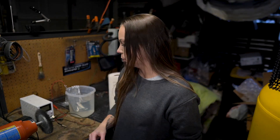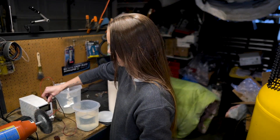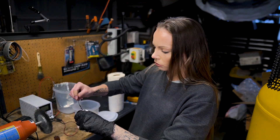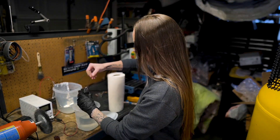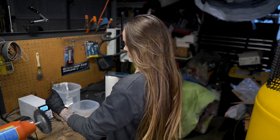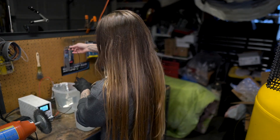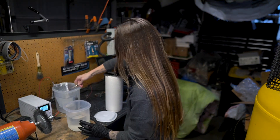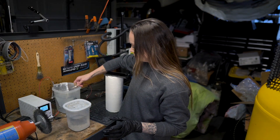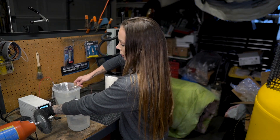I'm going to grab the other piece — I've already washed it — and we'll go up to higher voltages. So we are freshly and extremely clean, and we're going to take this directly into the etchant and let it sit for two to two and a half minutes. I'll turn on the power supply — it has been two minutes — and clip it on here. Submerging into the bath to neutralize the acid, I have it at 31 volts which helps keep it from oxidizing. It is anodizing right now. Checking the anodizing chart, I like that fuchsia color so we're going to go up to 67 volts.